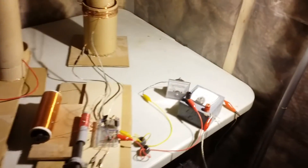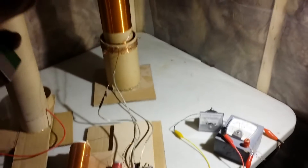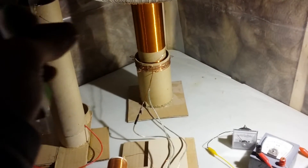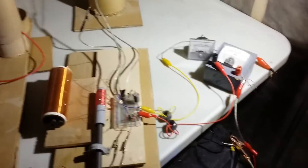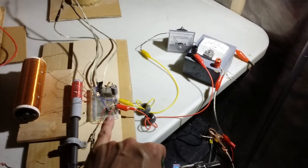There's always something I forget here, but in the past I had both towers lit up. I couldn't remember what I did, but what I ended up doing was move the base, or this 40-gauge wire, onto — from the collector to the negative rail there on the input.